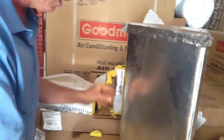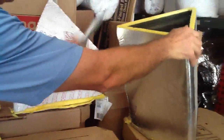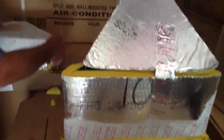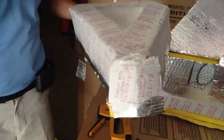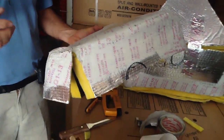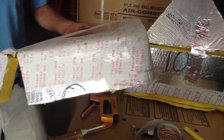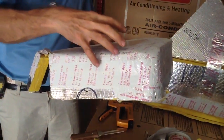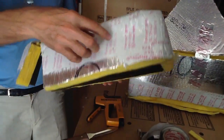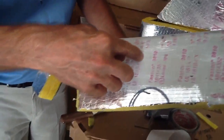I just wanted you to see the bottom of this. Here's what I don't want to see: some guys will take this and just tape, tape, tape. Here's one that was taped like that — the guy did a nice job taping everything, looks great. But think about this: when you take this into the attic and leave it in there for five, eight years — maybe next year — you've got that hot, humid attic air coming in. The hot air is going to cause this tape to come loose. Not only did he not staple it — there are no staples in here.